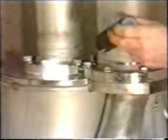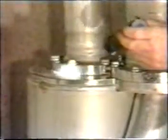9. Never start dismantling of any cargo pump or other component in the system before you know if, what and where you have a problem. Pressure test the cofferdam in order to detect leakages. 10. Cleanliness is absolutely necessary.